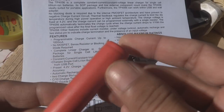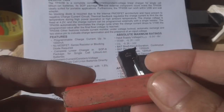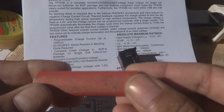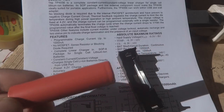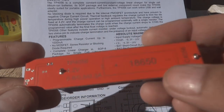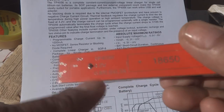We will be charging this battery using this module. There are different numbers written on the battery, but the battery rating is 3.7 volt typical and the current rating is some ampere-hour — say two ampere-hour something like that. They sometimes write very large numbers like eight ampere-hour, but I'm not sure whether that is correct. You can see what is written on the module: TP4056 — this is the IC number, the controller.